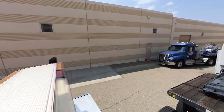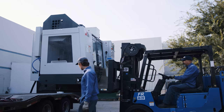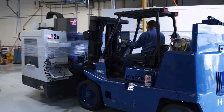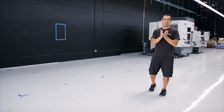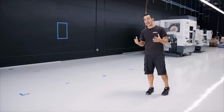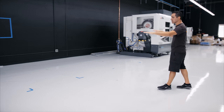Pretty exciting — both trucks got over here just fine. They're out back, starting to get the forklifts off. We have the VF2C, which was originally paired with the robot, but now we're going to pair it with the VF2B — our oldest machine. It has a 20-station umbrella tool changer. We don't need more than about 16 tools for what the robot has been doing, namely making pallets and Op Zero work for our pro pallet systems. Behind me will be the VF4, which is primarily our vacuum chuck machine. These two machines will be right next to each other.